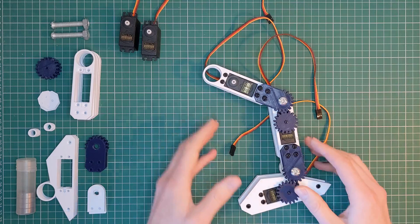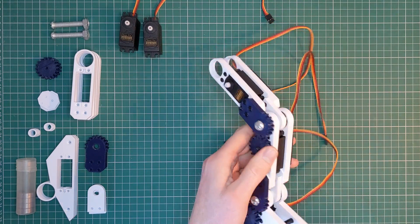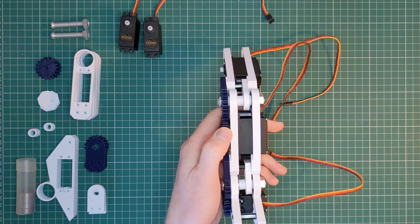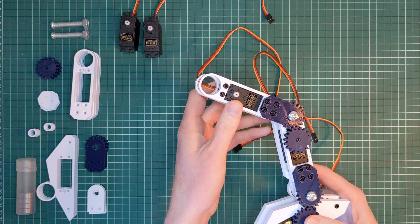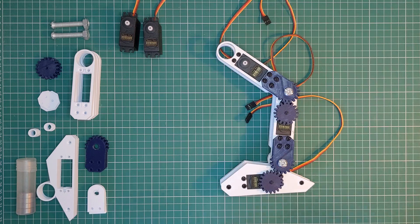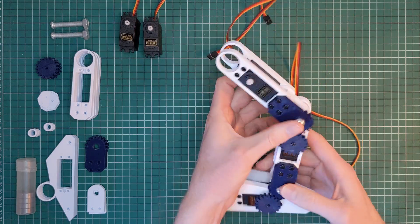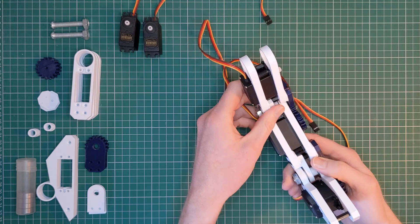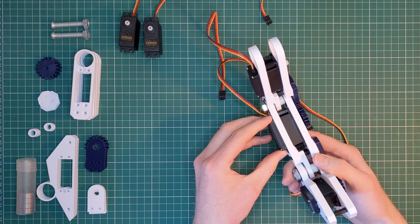The new version is a combination of these concepts and uses a completely redesigned frame and herringbone gears to enforce the alignment in a one-to-one ratio. Because this design is modular, if I want to change this ratio later I just need to reprint the gears and swap them out. This version is still 3D printed but uses PLA+ as it's less brittle than PLA. I'm using PLA+ from eSun as it has good reviews, and I'm printing on an Ender 3 Pro at 215 degrees.